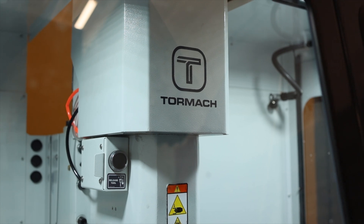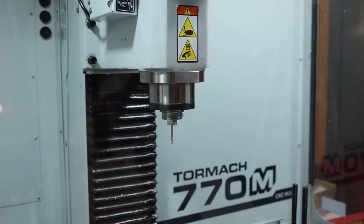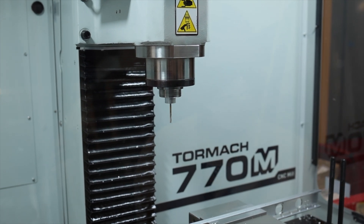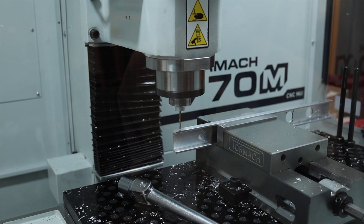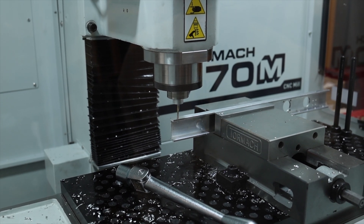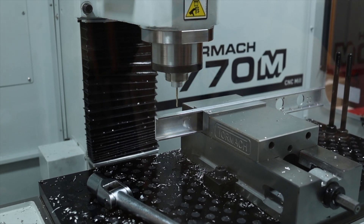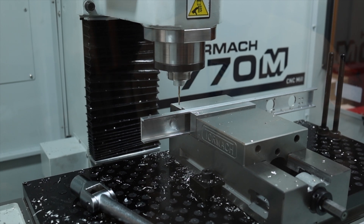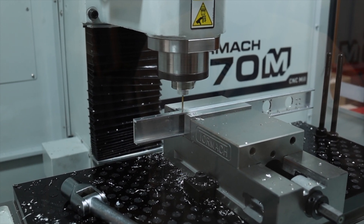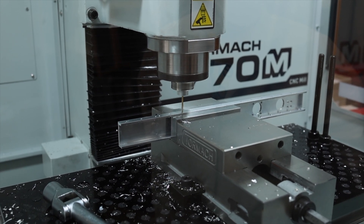After fabricating our drill bit collars, our second project tackled the need for versatile aluminum chassis for all four of our FTC teams. Designed in CAD, we utilized the power of G-code to map pathways for the CNC mill to follow, which produced evenly spaced holes into aluminum U-channel frames so the teams could assemble and mount their power train of choice. With help from our coach, Mr. Williams, some of the FTC members have recently started to learn how to utilize the machine.